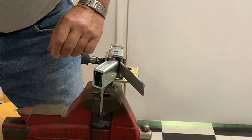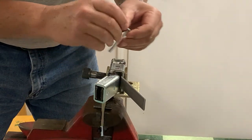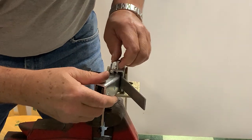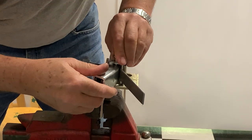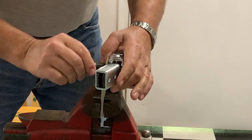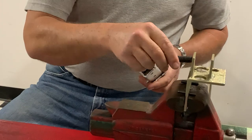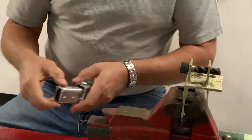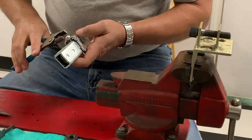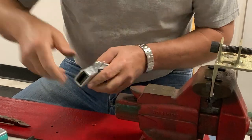Just a punch as a lineup tool, so now you can put your pivot pin in. The pivot pin is a carriage bolt, so you've got four corners to line up. Sometimes it's just a matter of giving it a little tiny twist and a tap, and back in place it goes.